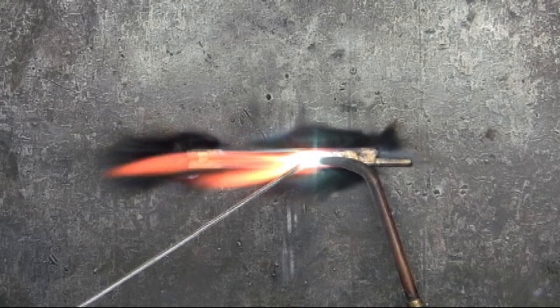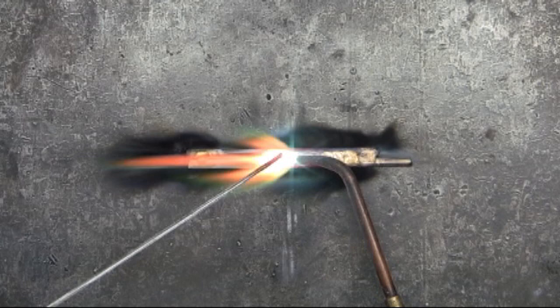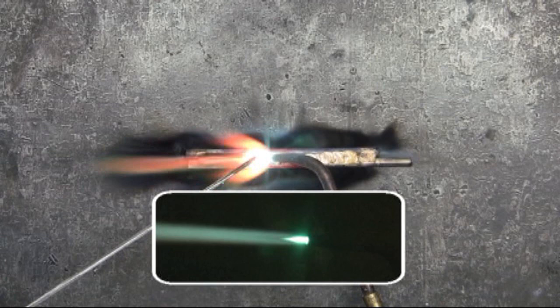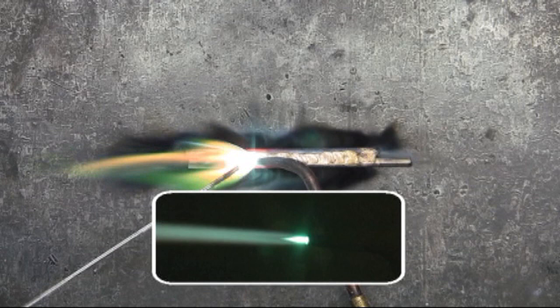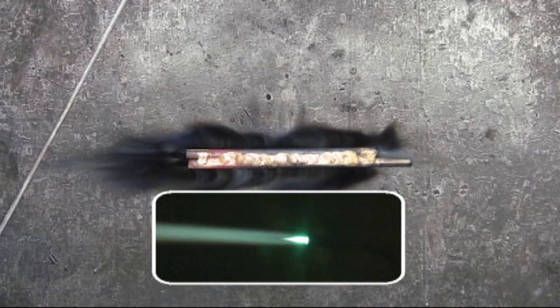Something in the makeup of the rod is not quite right. What I do when I run into almost any problem with brazing is to add just a touch more acetylene to the flame, generating a carbonizing flame. The carbonizing flame will help to smooth the brazing out. But as you can see here, it's just not doing it. This should be melting just like butter.